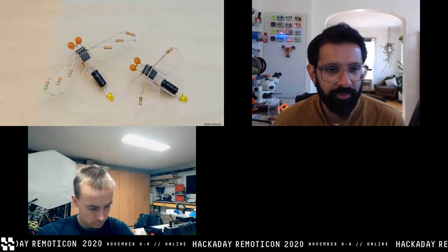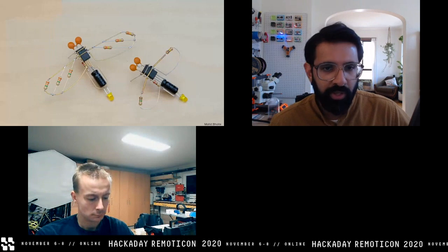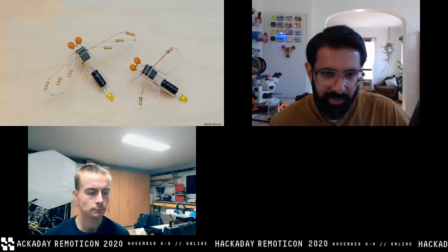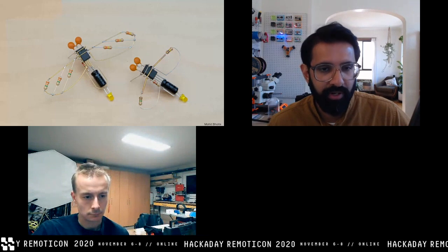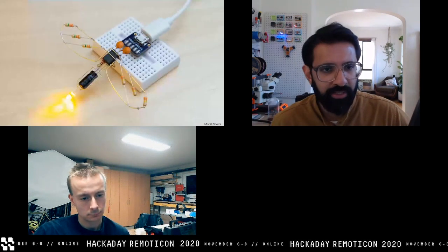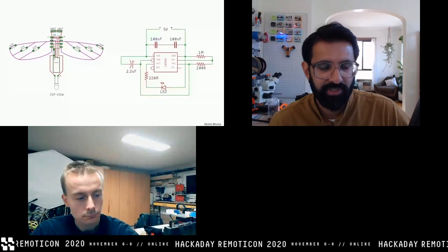I initially started by building a smaller quick prototype on the right, then made a slightly more elaborate version. The two capacitors on the front are just basic optional bypass capacitors that also act like eyes. The capacitor adds timing and the LED is at the back. Please feel free to take your own version and improvise as time allows — you don't have to finish the sculpture today. This basically gives you an idea of what the process looks like. Here's the underbelly of these two sculptures — I'm using 0.4 mm brass wire, but you don't have to use brass. I used Autodesk Eagle schematic capture to design the schematic and lay out the template. You can easily take a printout and use it as a template, just as Yuri taught us.